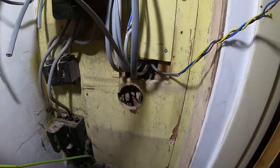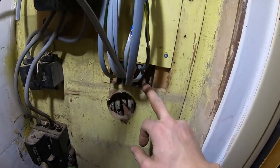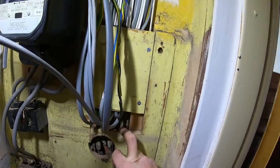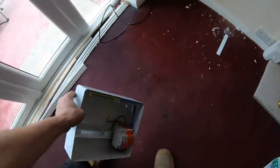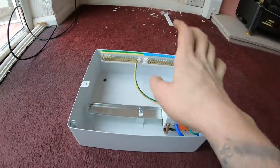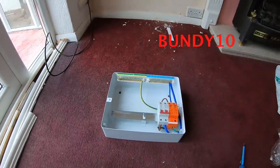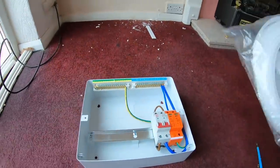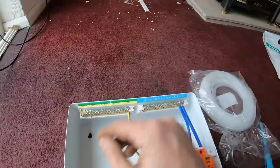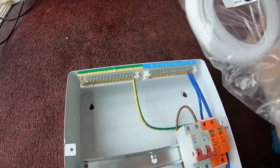Okay, this is what we're left with — just cut all them off, chucked all the stuff on the floor. It's all old rubber cable, a bit of a clear-out. I'll open the new board up — fingers crossed it's going to fit in this gap. This will be rear entry. We've got a 10-way RCBO surge-protected board from Fuse Box. Like I said in my last video, Expert Electrical have given me this, and I'll pop my discount code on top for 10% off Fuse Box boards — they are the cheapest by far on the internet, link below. I've gone to the wholesaler and bought a 25-metre run of grommet strip to go around — I'm going to do both knock-outs, put this in, and see how we're getting on.